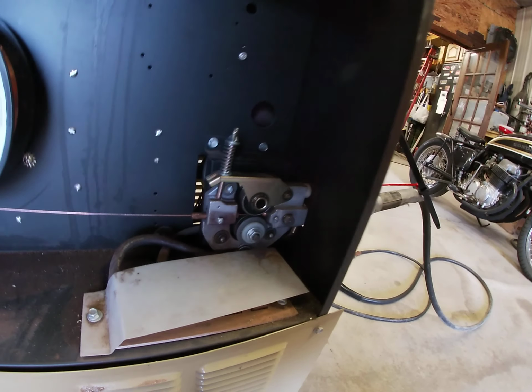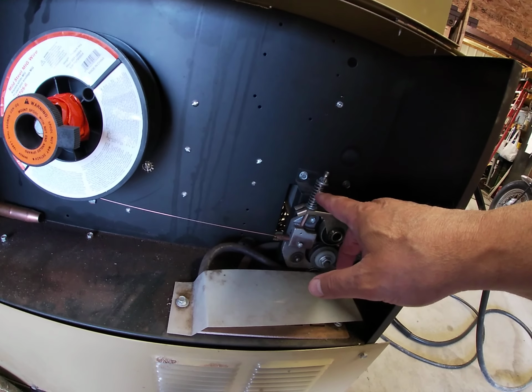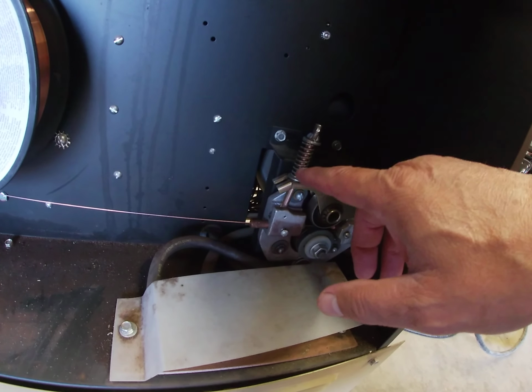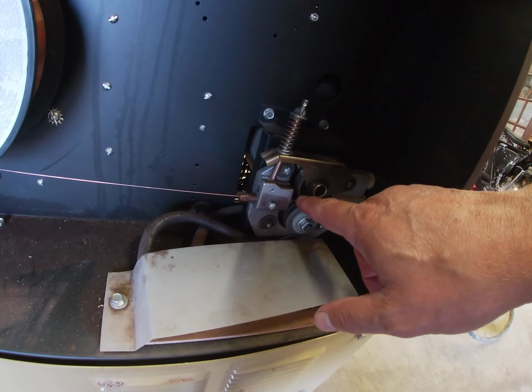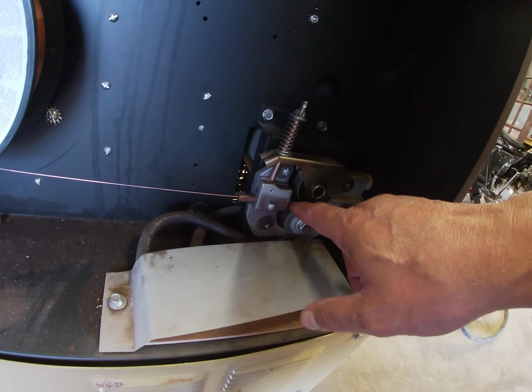So Gary was telling me, that's easy. I'm going, yeah, right. So for me to run it at the time, I put more thread onto this shaft, and then I put stacks of washers in there and just forced this thing down as hard as possible, to the point where I'm sure the idler roller was pushing so hard, top one to bottom, that it was still slipping.